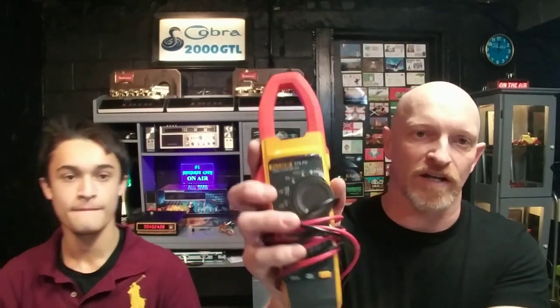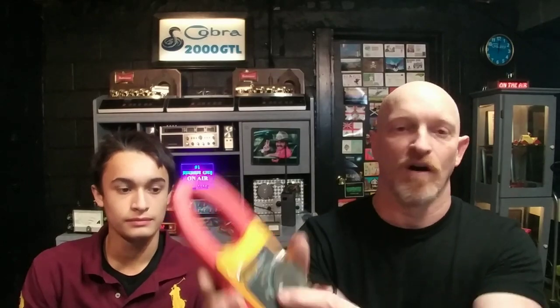We're going to show you something today that I made that's going to save the beginner, the amateur novice, the regular CB Radio guy that has a pile of microphones like me laying around but they came with no ends on them. And you're going to have a problem because some of these are no-name microphones. You guys that use a voltmeter can check it with the ohm setting. But the novice guy is not going to know that, so I came up with a quick, easy way to help somebody fix this to work on a 4-pin or 5-pin plug easily for under $8.